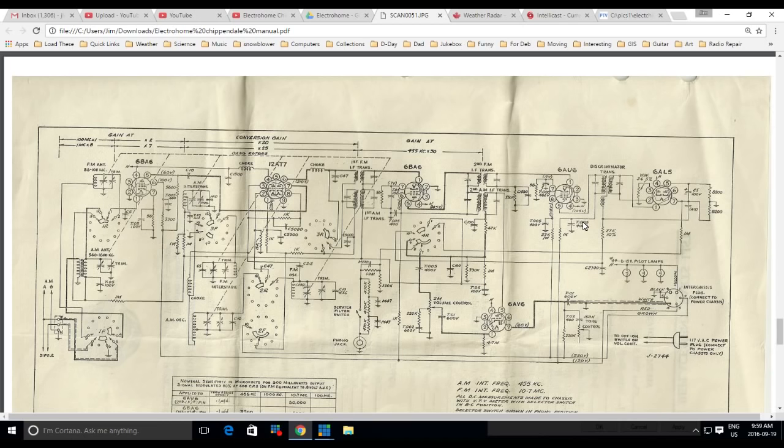So if this were seriously leaky, it would pull current through this 1K. That's a small resistor, the 1K, causing a little bit of a voltage drop. This 105. Oh, I measured this high last time, didn't I? Why don't we take a measurement of this voltage here? It's right on the high end of this capacitor, more or less. The one I just did. Ah, let's take a look.